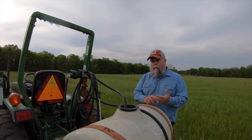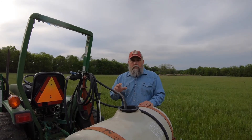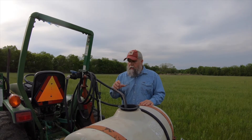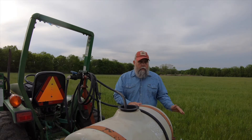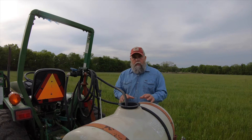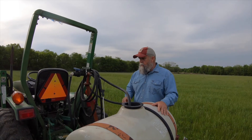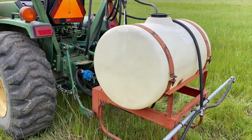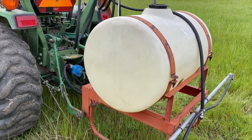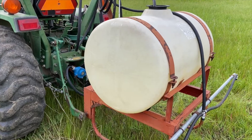It also makes the setup of spraying a field a whole lot easier. In this video we're going to talk about all the parts that come on a sprayer, the function of those parts, and how they relate to one another so you can get liquid from the tank onto your field — whether you're fertilizing or weed killing. The first part is the tank, which holds the water, fertilizer, herbicide, or whatever chemical mixture you may use.